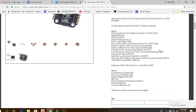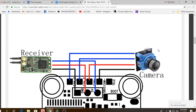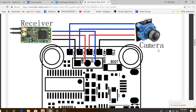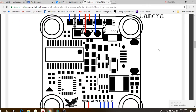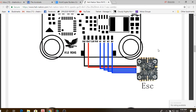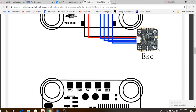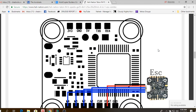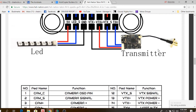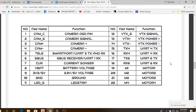Filtered video power for 5 volts and VBAT for the VTX. If you keep scrolling down the page, they've got a really good diagram for how to wire everything up. Everything makes sense and it works good whether you have the flight controller sitting upright or inverted. I have it inverted in my acrobrat so that I can gain a little bit of height back inside that small frame to keep the stack nice. It has everything that you need, it works good, and it's a great price.